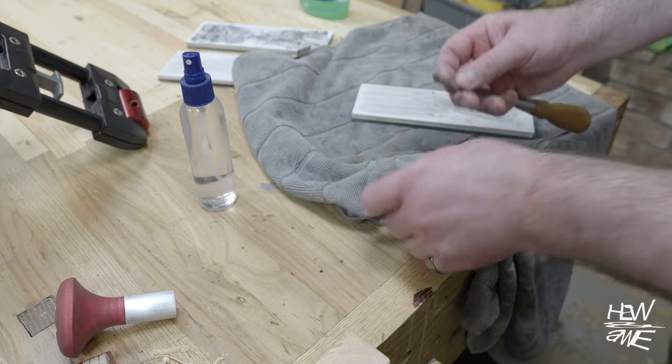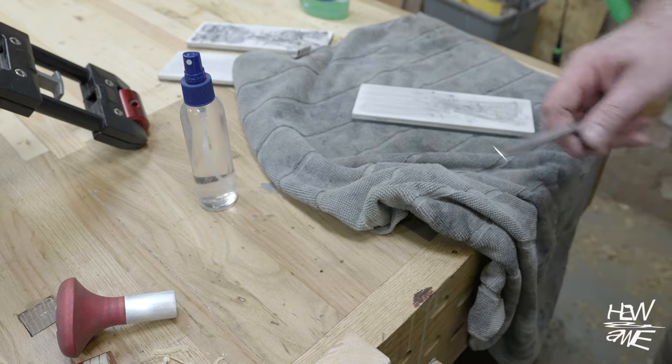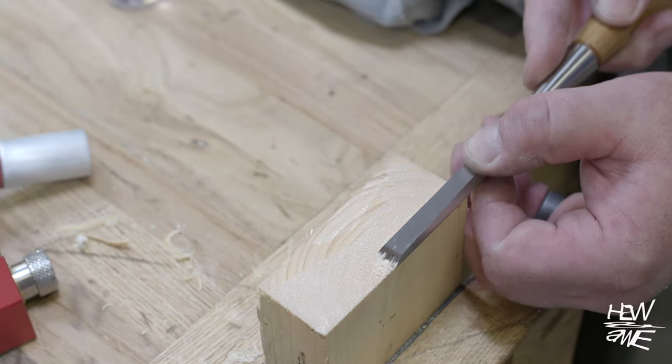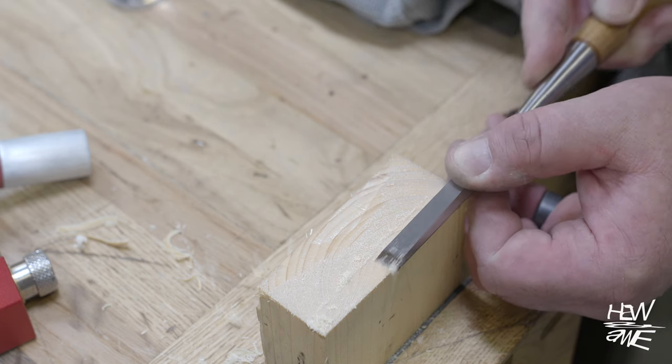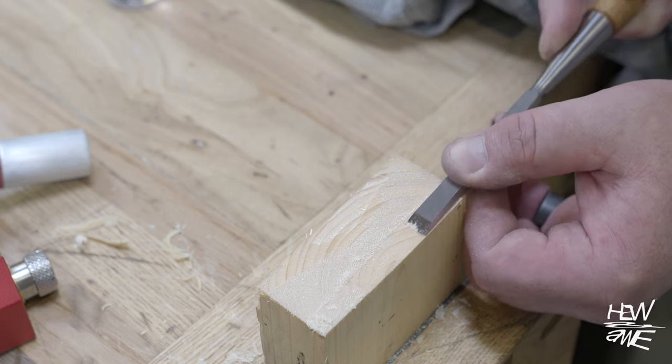Just to show you what I mean, that's 13 vinegar strokes on a secondary, on A2 steel, for the secondary bevel. You can see it's nothing to take home to meet your parents, eh? The cuts are fluffy at best. It's not that I'm not trying either. This has been demoralising me for at least 15 years till now.